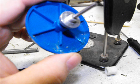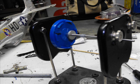And from here I put it back on the balancing shaft. What we're looking at here is, of course, the base plate of the shaft. My witness mark is now 90 degrees off the side. I've rotated it, and it stopped in multiple positions. So now I know my spinner base is also good and true and balanced. Should I have any vibrations after this point, I know I still have an issue with my motor.